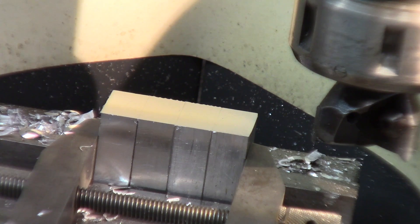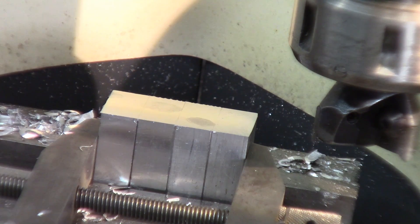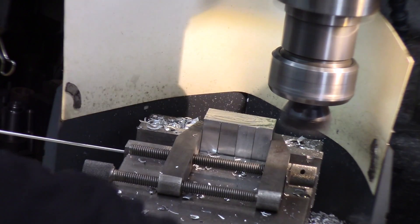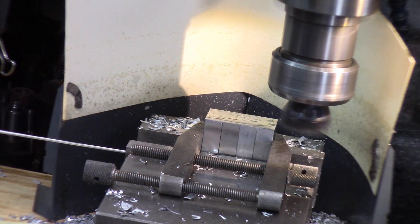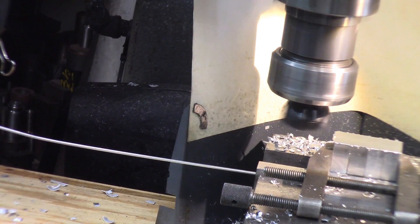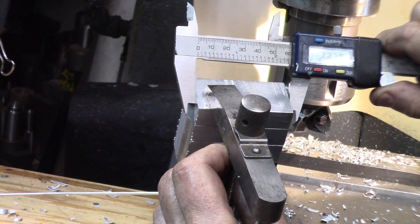I'll get down, remove this, go to zero on my DRO, then two to three thousandths, and I'll be within a thousandth — very close. So with this it saves me trying to get the measuring tool around there. Drill blocks, or anything you know, makes measuring easier. Now let's just do the cut — a little bit of cutting fluid. I'm going to go easy enough. I was aiming for 2.375 — there you go.